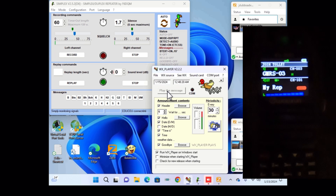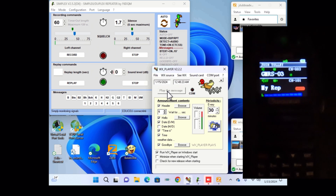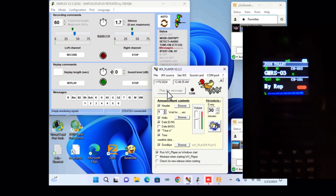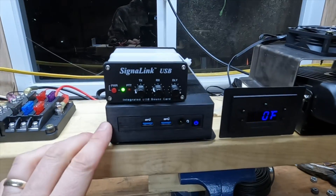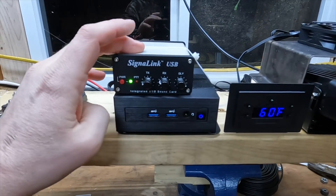"Welcome, this is the Cover Pin One GMRS repeater. This repeater is connected to GMRS Nationwide." So you need that little boop and then that triggers your VOX setting — that's what I don't like. But it does work okay. As long as you key up your radio, sometimes you can make a noise or the squelch breaking is enough for the VOX, so it works fairly well.